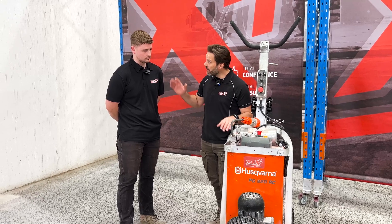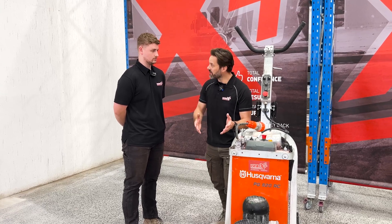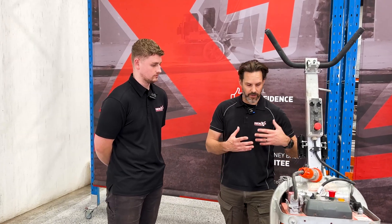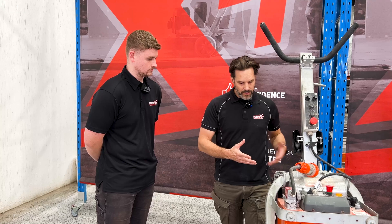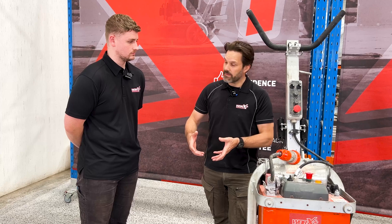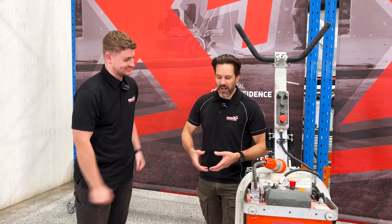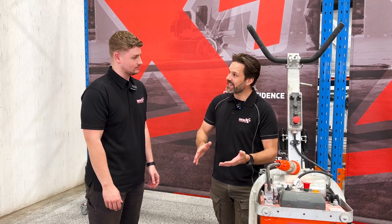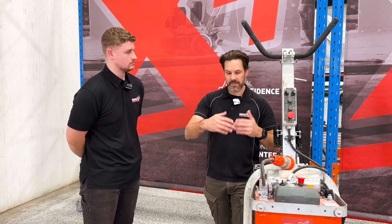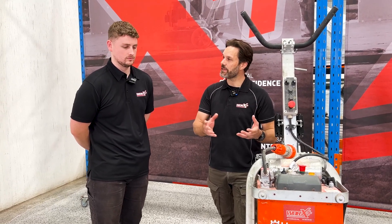Now, if I said, 'Brandon, I'm done for the day, it's your turn,' it's very, very difficult for me to say to you, 'that's around about the speed I was travelling at,' and have you actually transfer exactly the same. This is problematic when we're creating a finished product. Come along radio control — now we can actually dial in those speeds. I could hand over the radio control to you and say, 'just maintain those numbers,' and it's going to sail along at the same profile behind the machine, the same scratch removal speed. All the processes are now done at the same speed, as you would expect in a manufacturing facility.